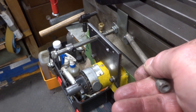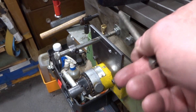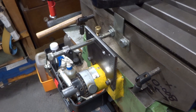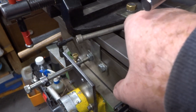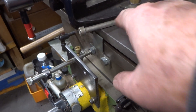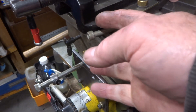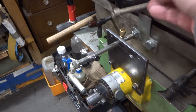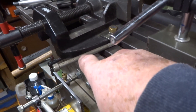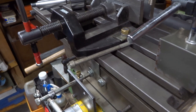As I said previously, the x-axis stop is fixed by two M8 bolts into the table of the mill. If you don't have any long M8 bolts, there's a little job for your lathe: take a suitable length of suitable diameter steel, thread one end M8 to screw into the table as I've shown, fit a locking nut, and do it that way.